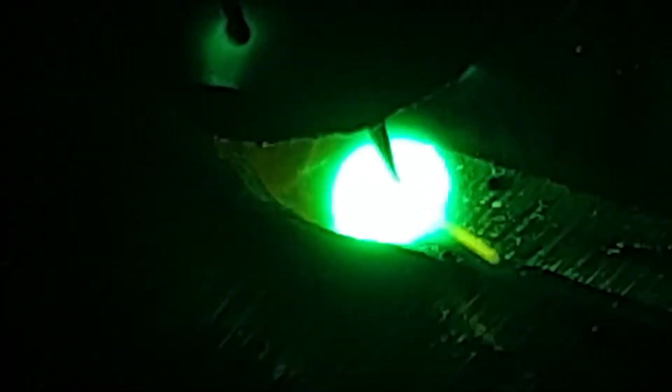If your travel speed is too fast you won't penetrate through the material, or your root will be too thin and very inconsistent throughout. On the other hand, if you move too slow, your root will be too thick and could put too much excess weld material on the other side of the plate.